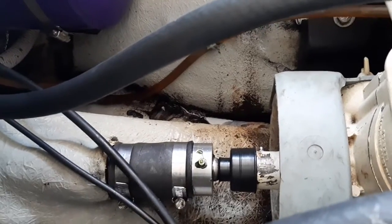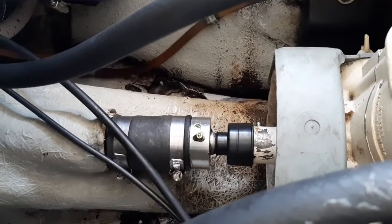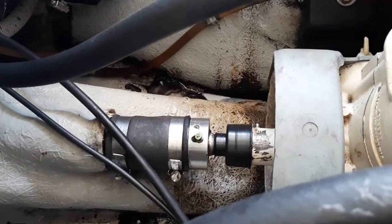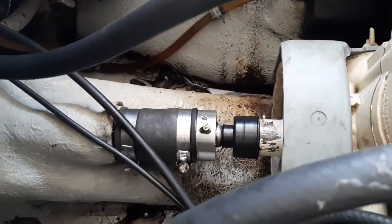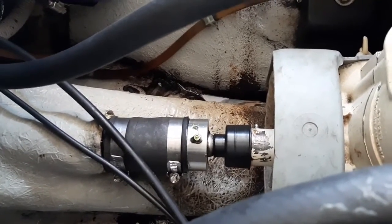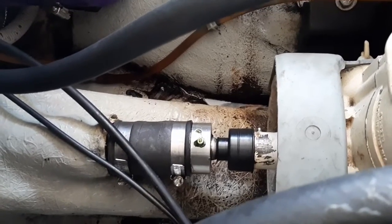If you watched my other video — I'll put a link in the description — about the drive shaft seals, I do have the older style seals that I think do a better job of keeping air from getting into the pump. The way they're set up, when you pull the pump out the drive shaft will pull right out of the PTO with no problem. If you have the carbon ring style seal, the drive shaft will stay in the motor because it's got a clip that holds it in place, so you can just pull the pump off, grease the splines on the impeller, and put it right back together.